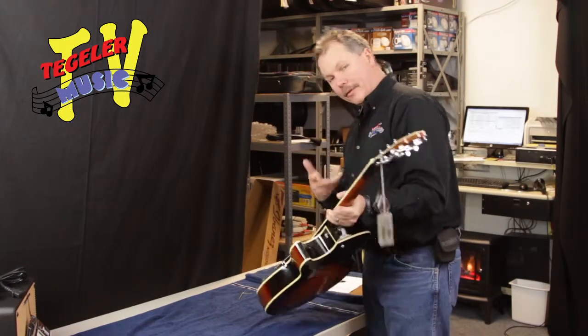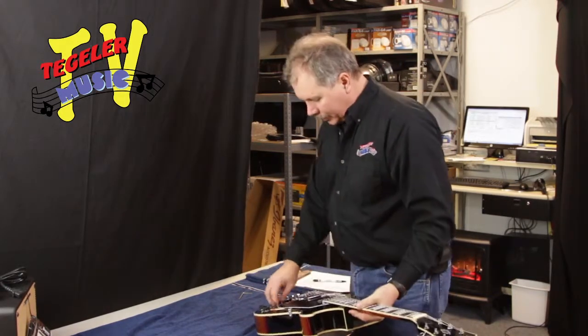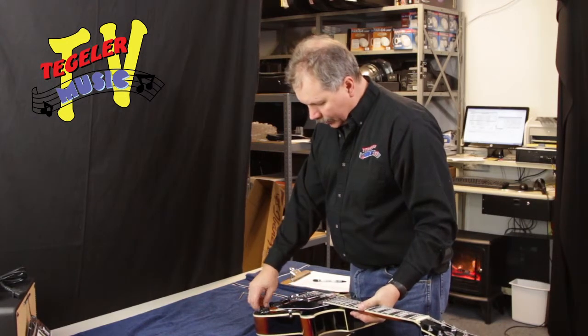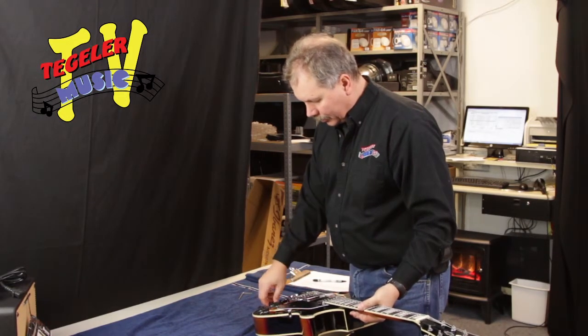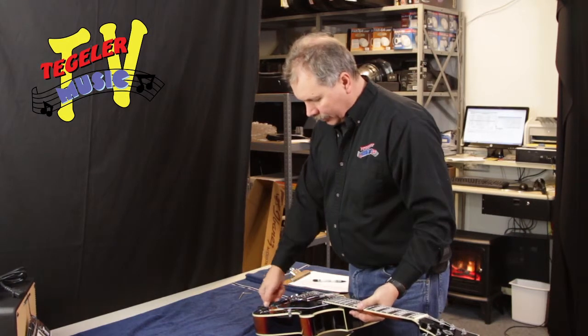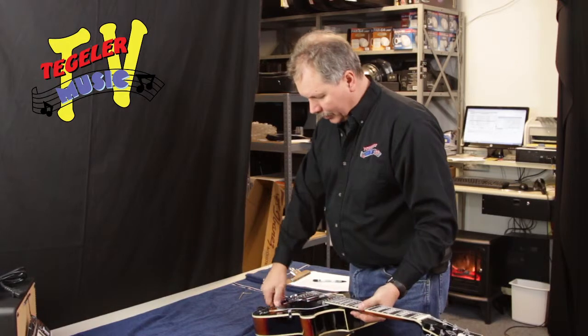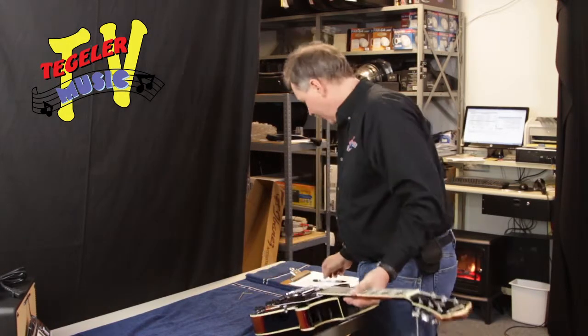We're checking the pots now — we've got some electric ones we haven't done with the acoustics. Make sure that they all turn right and make sure they're not loose. When they get to 10 they shouldn't move at all — they should just stop. If it's loose, it might feel like it wants to move further; that's just because the pot's not tightened into the body. Those look good.